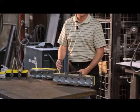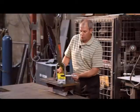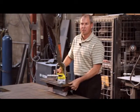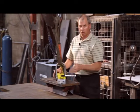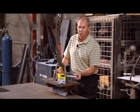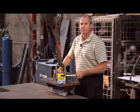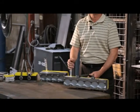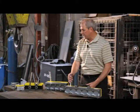These lifters feature the technology advantages of ease of actuation on thin material. Notice how easy it is to turn this lifter on on one inch thick steel. Compare that to old technology — the same capability 6,600 pound, 2,100 pound rated lifter would need at least two inches of steel to turn on. So: better hold on thin material, easy to actuate, and stronger in the presence of air gaps. That's what you get with MagSwitch technology.